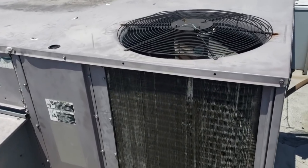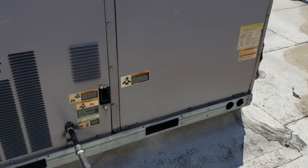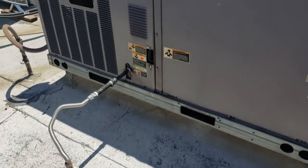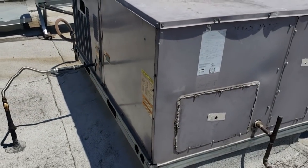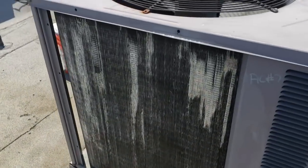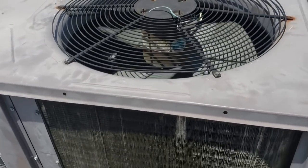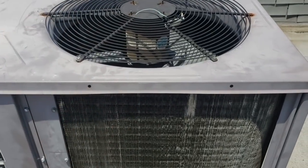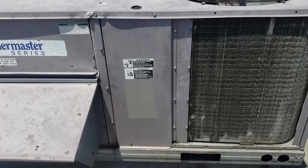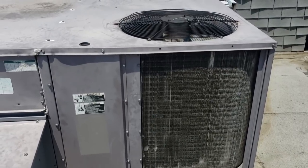The unit is back up and running — everything's looking good. We redid a bunch of electrical, replaced the contactors and the compressor, fixed the refrigerant leak, and adjusted the refrigerant charge accordingly. Someone has a lot of incorrect parts on here but I'm not going to change them yet. That motor doesn't belong on this unit — it's a little bit big, so it makes the condenser blades sit lower and the unit runs a little higher head pressure because of it. It needs a metal mesh filter and the panels are completely destroyed on this thing, but it is what it is — it's operational, it's working, they're happy. Condenser's as clean as it can be.